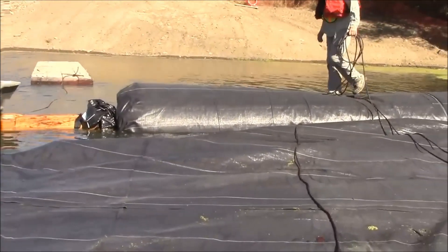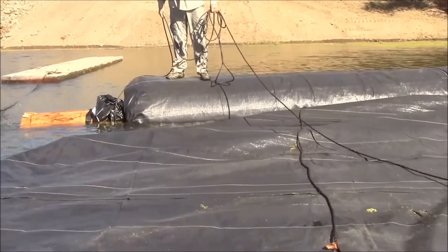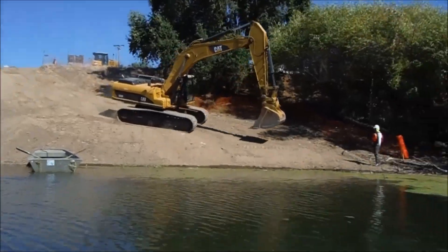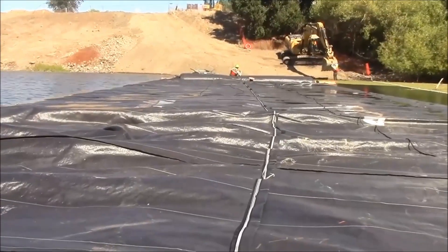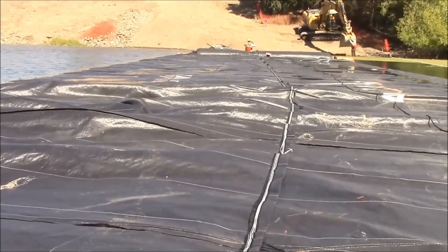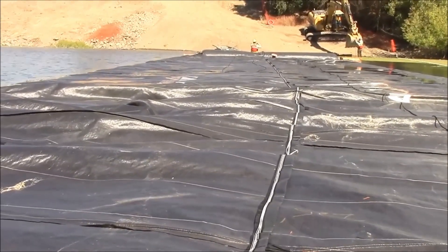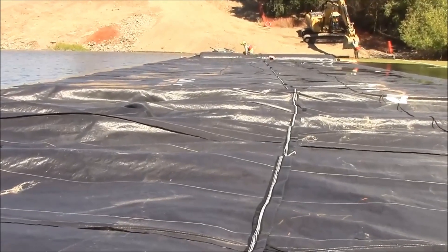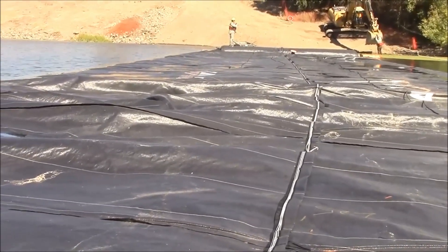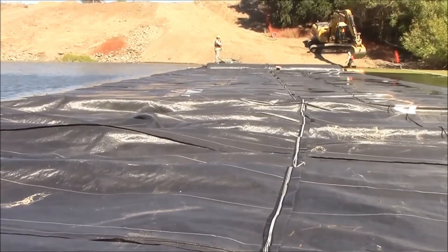It's important to be square with the bank because that's where you get the most support for the end of the aqua dam. The aqua dam is floating right now — there is standing water on top, so it's buoyant in the water with no influence or separation between it and the local body of water. You should be able to just slowly pull it until we get the appropriate angle on the face to marry up to the bank.